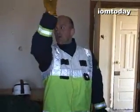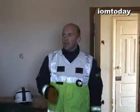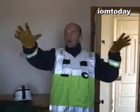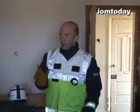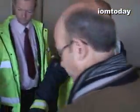It's that easy — they just unscrew and put another one in. At 57 degrees the sprinkler comes out, and between 68 and 71 degrees the sprinkler operates and it will cover this room. Any fire in here, it will not necessarily put it out. For example, if there's a video in that TV unit that started on fire and was generating heat, the water couldn't physically get to it — but what it'll do is check it and hold it there until the fire service gets here.